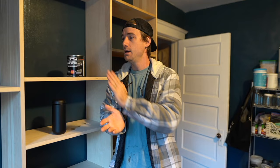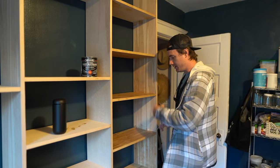That makes sense. We were testing some stuff, and they really wanted something a lot lighter, a little bit closer to this. Well, that's based on the wood filler that I used. It was not gonna work at all. And we decided to go with a warm satin polyurethane, which gives it kind of a nice golden tone. You were gonna be able to tell that that wood filler was there. And the alternative was digging all of that out and then putting in those little pocket plugs.